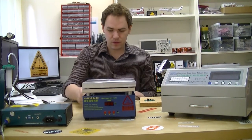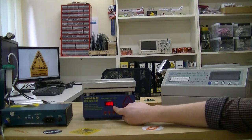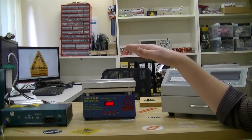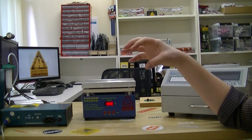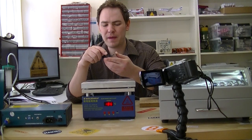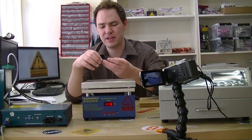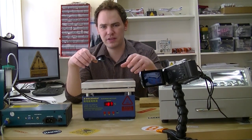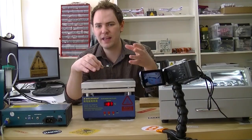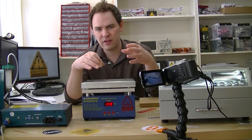So let's get to it. We'll turn this on — the temperature is adjusted digitally in the front. I push the star button and it shows us the set temperature: 180 degrees Celsius. When it reaches 180, we'll put the board on top and then crank the temperature up to 240 degrees until the solder reflows and everything positions. We're testing with this board because it has a variety of components in different sizes — it's got a big power jack, a few big FETs, but also some small 0603 components and case A capacitors. So the reflow plate has come up to 180 degrees Celsius, which is basically the initial temperature of the reflow oven too. I'm going to put the board down, let it heat up for a second, and then adjust the temperature up to 240 to actually reflow the solder and solder the parts to the board.